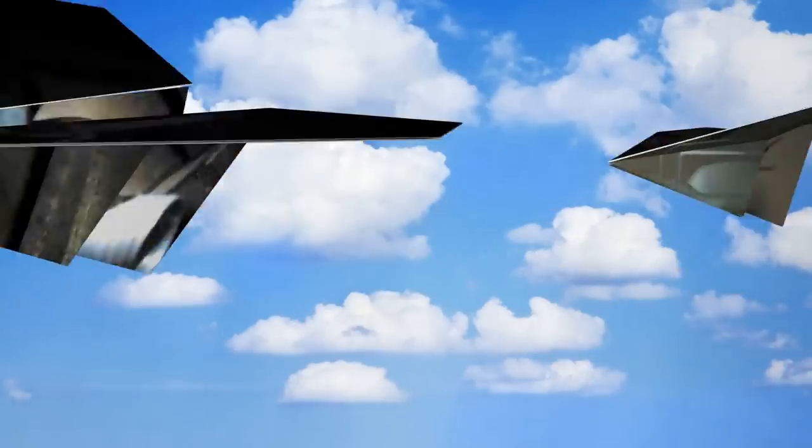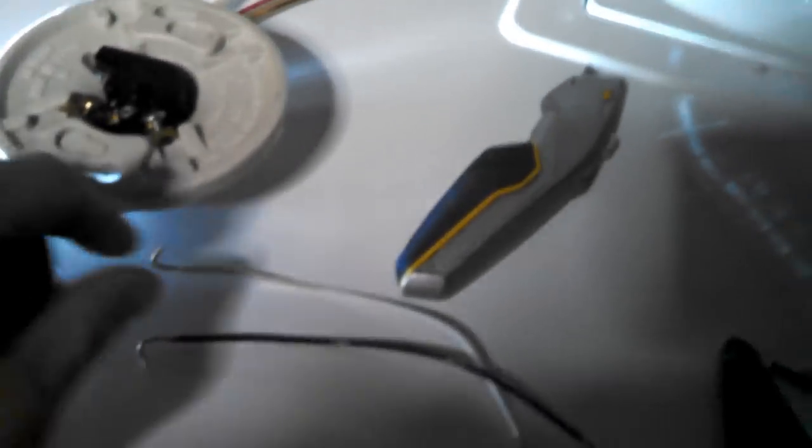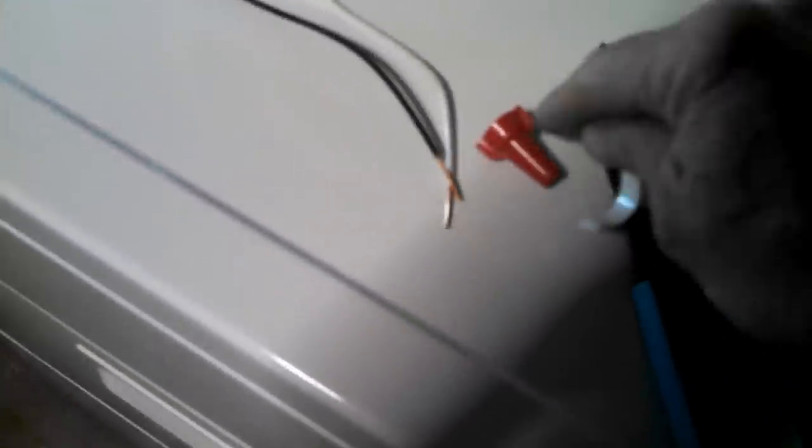What you're interested in is the two wires that go directly to the lamp. The old one was that different style with the screw-in insulator. The leads are really short, so you can't get in there to hook these up. So what I've done is make what they call a little pigtail. I just took some 14-3 wire, opened it up with the utility knife, and took out a white and a black about 8-9 inches long. And I stripped the ends with the wire stripper. This we're going to pigtail onto the existing wires in the box with a couple of wire nuts.